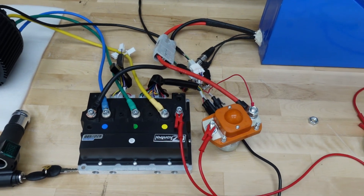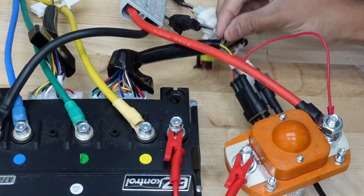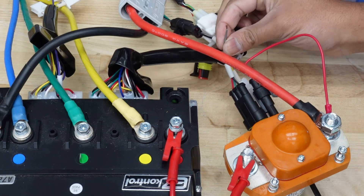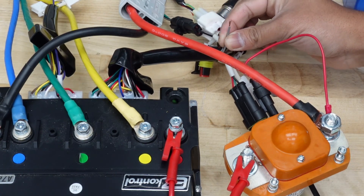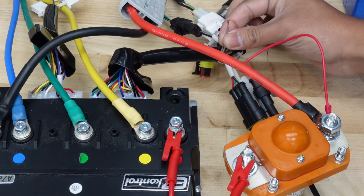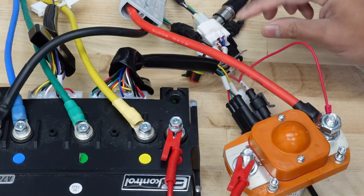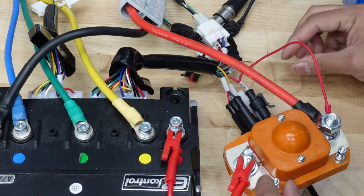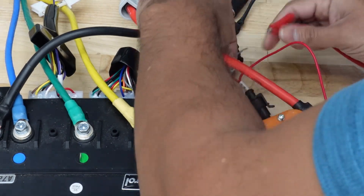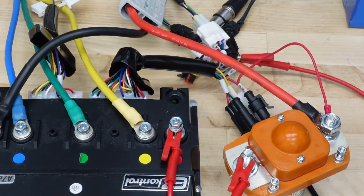Two more connections. I'll zoom in on the main wiring harness — I'll also put a diagram of the full connection on screen for reference. Out of the main wiring harness, there is an isolated gray plug. This gray wire is specifically meant for the DC contactor and goes on the secondary connection on the DC contactor — connecting to A1.